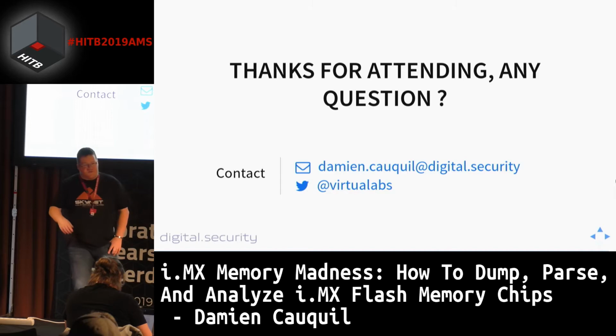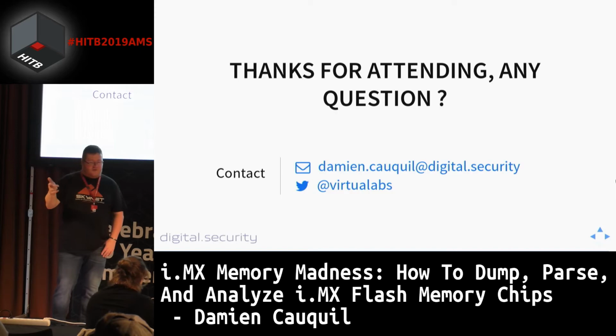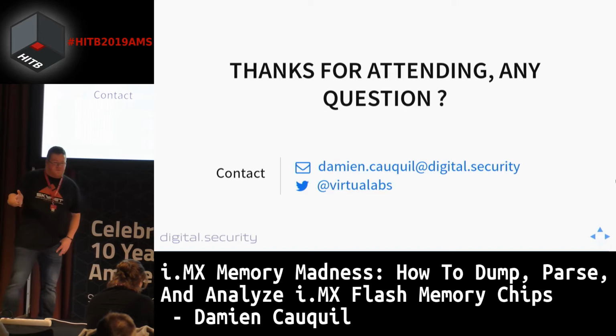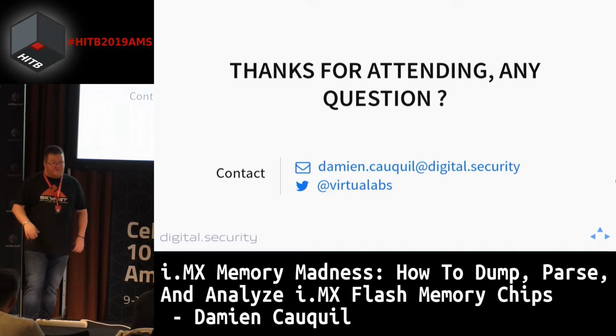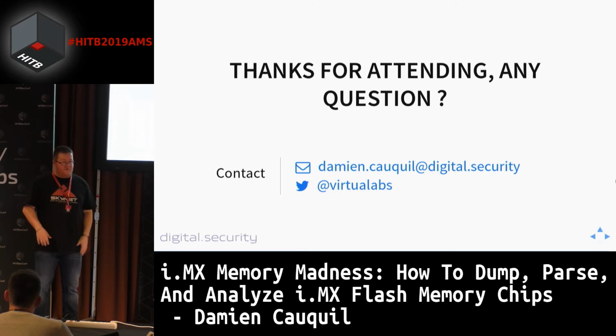So if I understand well, you monitored the CPU and you saw that it reads 1 kilobyte plus 13 bytes on a page, where the datasheet stated that it's a 4 kilobyte page. Yeah, 224, for instance. I have another explanation. Maybe it's some kind of variant of a specific version of a chip. You know, when you go through the datasheet, there are some specifications that are very standard, such as the one I showed you. But in fact, there are some variants of NAND flash chips in which the page size may change. So be sure to take the correct datasheet when you are doing this. It may be an error from the documentation itself. You know, sometimes people writing these datasheets may make errors. But in fact, it's not so common.